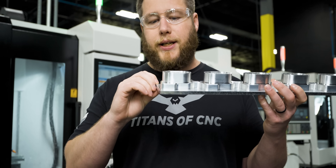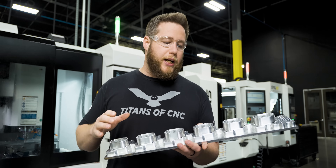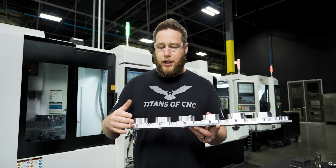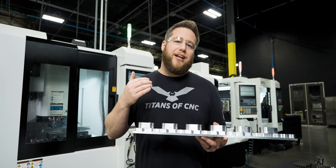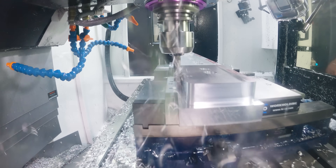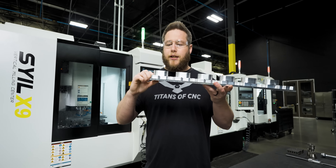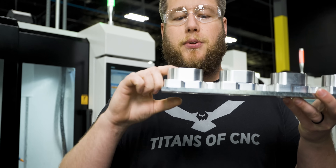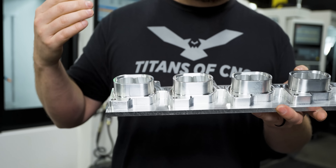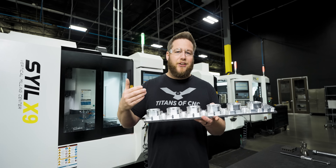This is about 1.4 inches deep plus a hundred thou stock I'm leaving on the top, so right at an inch and a half. What I found on the first one is that when I ran at that depth with the step-over and feed rate I was trying — 300 inches a minute — I had to slow down the feed rate because I didn't have enough power unless I dropped my RPMs, and I wanted to keep those elevated at 8,000 RPM. I found when it did this bottom depth and then stepped up to the next depth, because of the really odd profile, I was having to do a lot of slow-downs and speed-ups — a lot of accel and decel because of this shape until that was roughed away.